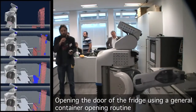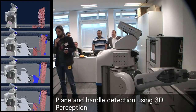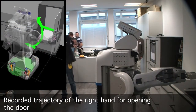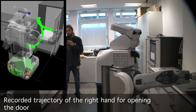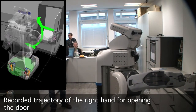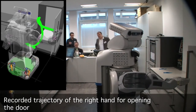We're making the pancakes. Here we use this controller that basically just opens about every container here. We were tipping with the fingertips against this because we had good laser perception, but still this can be off by a centimeter or two. By just using this tactile feedback of touching the handle before we grasp it, we have a pretty good estimate of where it is actually, and then we can just grasp it right away.